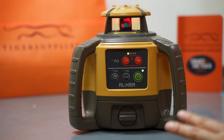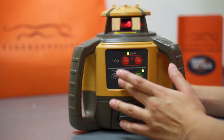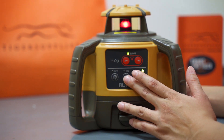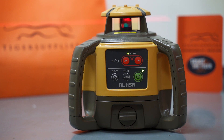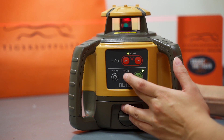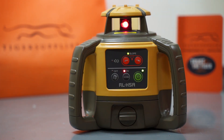We also have two more buttons: the manual button and the height alert. The manual is going to be used once you are at a job site that's very shaky and has a lot of vibrations — the ground is not very stable. You want to turn it on because your laser will not be auto-leveling itself every five seconds. It understands that it's actually vibrating and doesn't need to keep trying that process again.